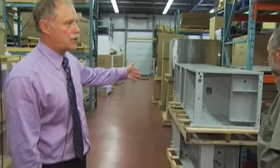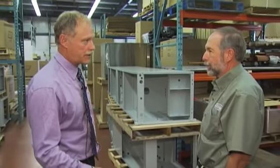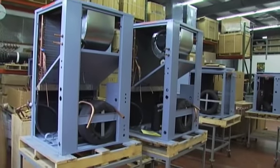They can be horizontal units, water-to-air units like this one, or mini slim units for a large building — these small units fit in the two-foot space between the floors on a multi-story building. A building like that might have 50 small two- or three-ton units. We sometimes heat swimming pools, very large buildings. Our largest machine right now is about 65 ton and would easily do a 50- to 60,000 square foot building with just one unit — that could be a school or a retail outlet. Commercial is starting to catch on with geothermal. We started out with residential, but now that the price of oil has gone so high, commercial operators with large heating requirements are really able to capitalize on a quick payback. Years ago we used to make two, three, five-ton units for residential — now it's not unusual to be making 35 to 60 ton units. 60 tons means it's times 12,000 BTUs — not the weight of the machine, but the actual heating capacity.